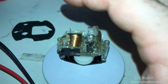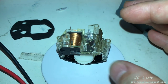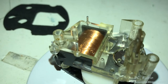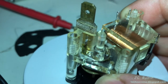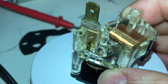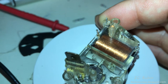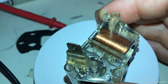Now that we've taken the circuit board out, we can inspect the coil with a continuity tester and get an ohm reading. The coil was good on continuity and read 290 ohms. There's also a fourth pin I neglected to mention — it carries the 12 volts back up to the circuit board. The center third pin is structural, where all grounds connect, and doesn't go anywhere else.